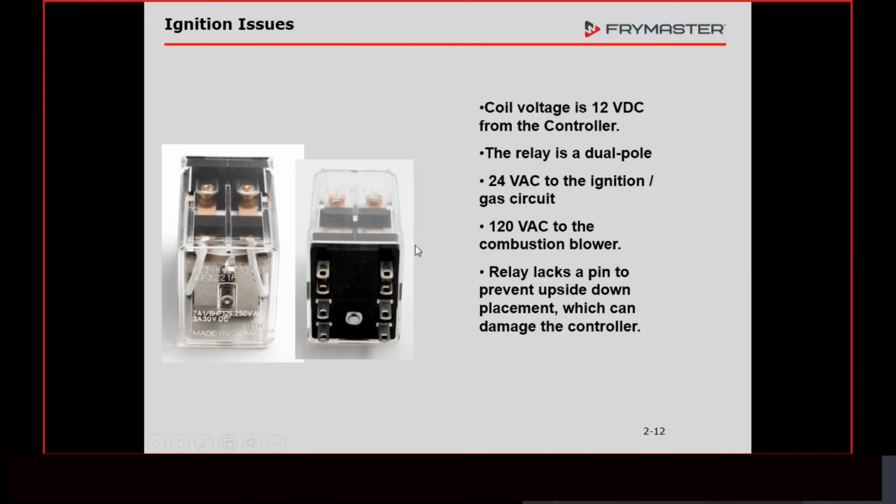very important. If somebody was to ask you how often it should be changed, my answer is always every year. After the fryer is a couple years old, it needs to be changed every year. Because after it's a few years old, everything else is getting older, works a little bit harder, which makes this work a little bit harder. Even if you just left it at every other year, I don't think that the cost of this relay is overkill because of the damage that a bad relay can do.